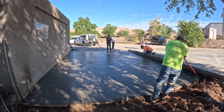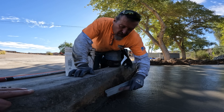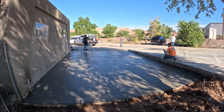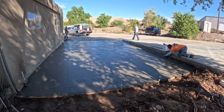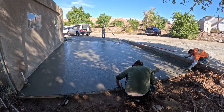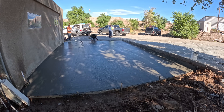Here's Kenny and his magnificent plan. He's pulling a little bit — right now the concrete is not going off that quick. We've got some time to work with stuff. We're down around 45 degrees in the morning, getting up to 70. We can pour year round over here in Arizona. So basically what he's done is packed it a little bit on there really loosely. He can't pack it hard at this point because it would slough off into the slab and raise that slab elevation. When you drop your rail for the structure it may not set flat. So it's a very tedious process.